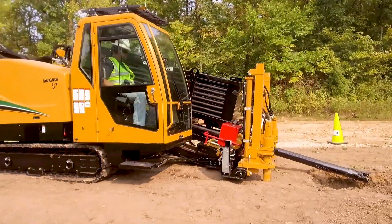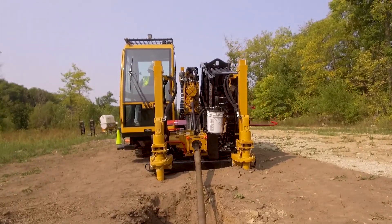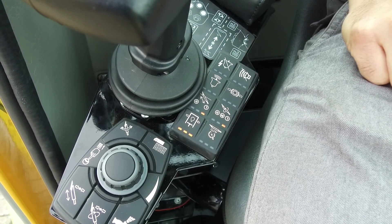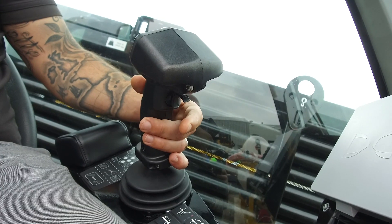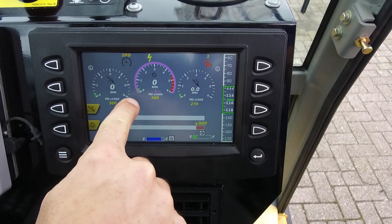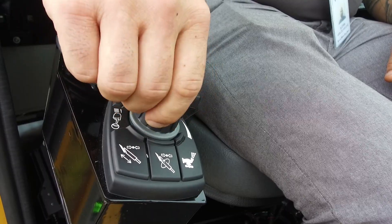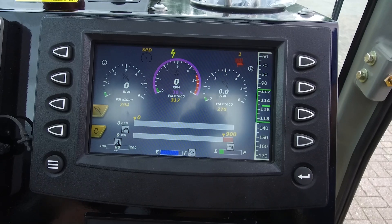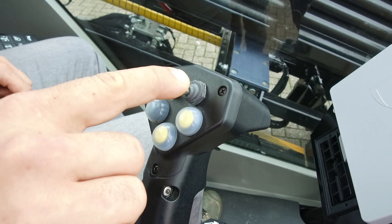I'm going to show you now how to start the inner rotation on the D40x55 dual rod Series 3. Start the drill according to the starting procedure explained in the operator's manual and enable the hydraulics. Check if the thrust/pullback selection is set in thrust mode. Turn on the inner rotation by using the trigger on the left joystick. Now the inner rotation gauge on your screen will highlight purple. You can now set the inner rotation speed with the dial controller. The speed is now shown on your screen in percentage. The inner sub saver will now rotate if the thrust/pullback selection is set in thrust mode, the front vice is opened and the mud pump is enabled.